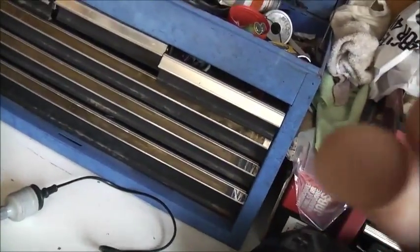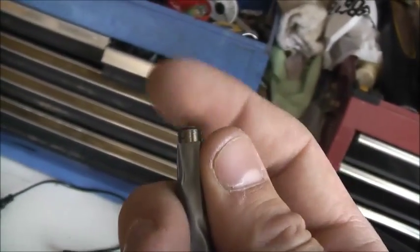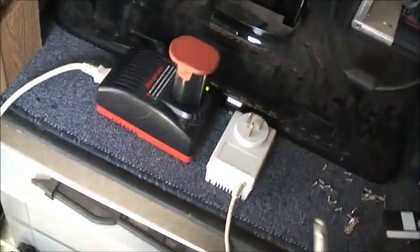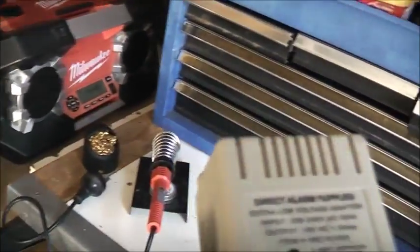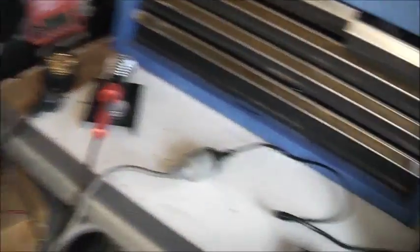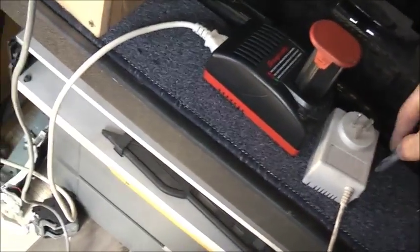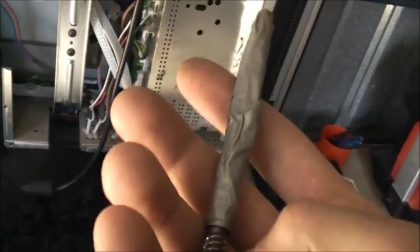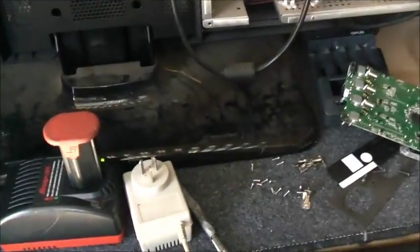What a great demagnetiser. Don't touch your head with this stuff because it's going to scratch and damage your head — just get close to it, wave it and move away gradually. This worked perfectly. A similar method goes for CRT TV degaussing coils. You get a degaussing coil salvaged from a TV, you hold it to the screen and just wave it back and move away — that's the method you use for it to work. Looks like my technique paid off. That was a first time — not bad for a first timer. But you never use a permanent magnet to demagnetise; all it does is magnetise it more and does more harm than good. My homemade head demagnetiser works well.